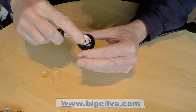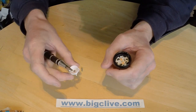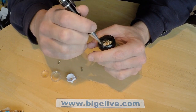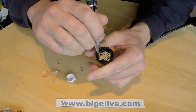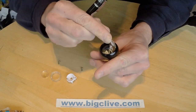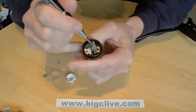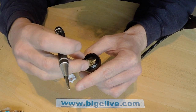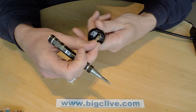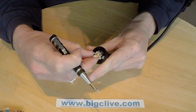Single point LED in here, with components on the board next to the LED. That holds the little heat sink in place. It's got a Cree chip in it, which is quite nice. This housing is an aluminium type material, and there's a sort of gap in the middle for the cable to come through, and then there's heat sink compound on either side. That's just a circuit board — it's not an aluminium substrate board with the LEDs on — but at the back is solid copper. And it's got a lot of bonds through to help transfer the heat through to it.